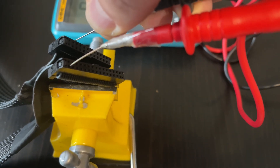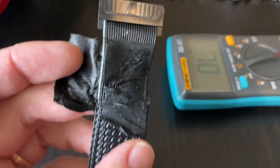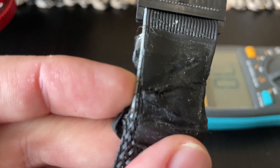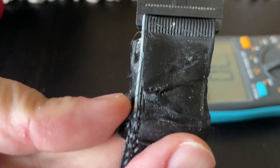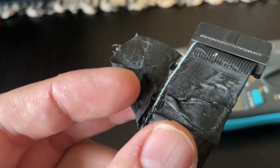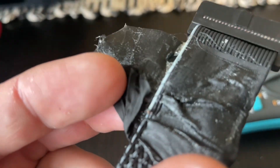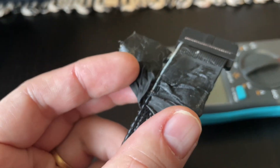I double-check that pin — again no sound. Wiggle it a little, move on to the others just to confirm. Yes, continuity on the others, so the problem is on that first pin. Since I'm going to replace the cable anyway, I stripped it out and found a little cut in the white wire. The movement of the printer bends that wire thousands of times every print and it eventually split. The second wire is almost gone too, so it's time for a replacement.